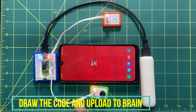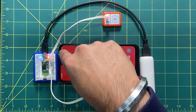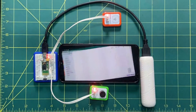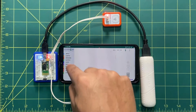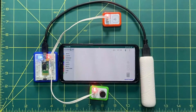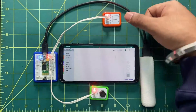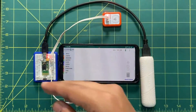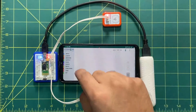There are three major things to keep in mind: connections should be done properly, the power bank should be charged, and the Bluetooth connection should be activated before programming. Open the TinkerOrbit mobile application. The workspace is empty right now, and these are the options from where we will drag and drop blocks. The logic is: once I place my finger on the touch sensor, it will take the input, and that input will activate the buzzer — an on and off condition.